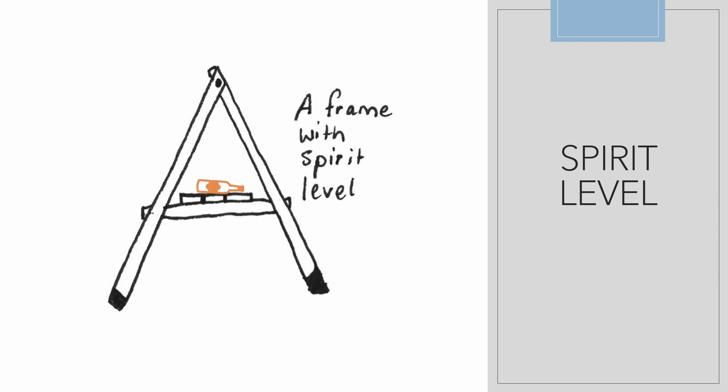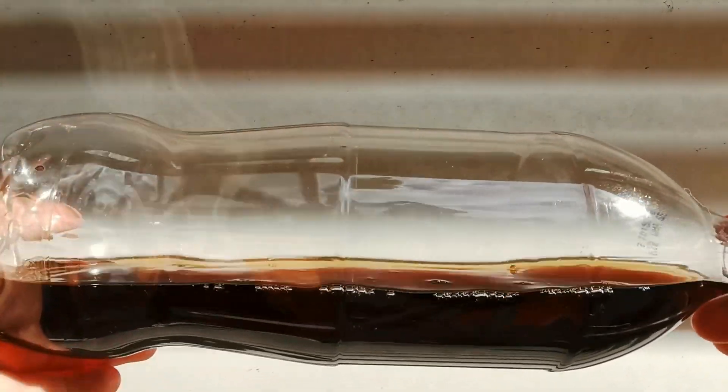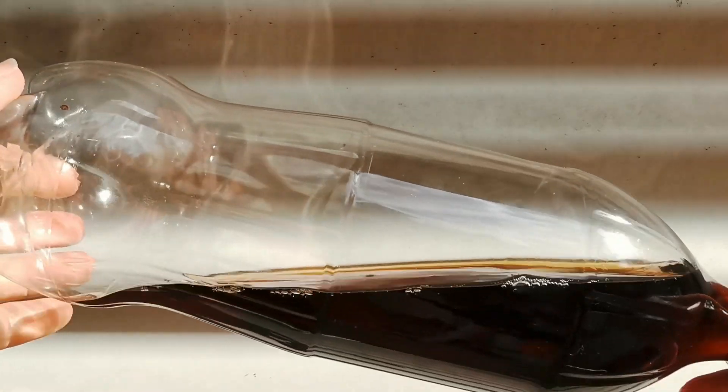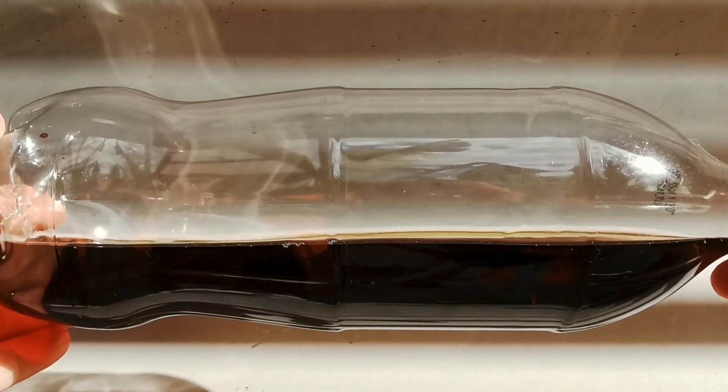The second type of A-frame just has a spirit level attached to the horizontal bar. You can make a spirit level with just a bottle and some coloured water, and you attach that bottle to the horizontal bar. The bottle doesn't have to be square or cylindrical — it can be odd-shaped like a Coca-Cola bottle — because you know that the level you see in the bottle will be level, and you compare that to the horizontal. Again, you should calibrate it to make sure the horizontal bar is level.